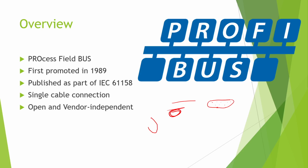Now, another fun part about this is usually we're going to have a purple cable. That's going to help denote Profibus. Why purple? I don't know. I don't think it's in the standard that you must use a purple cable. Really any cable will work, since it's not carrying that much voltage or current. Probably some 22 gauge wire would be perfectly fine depending on the distance you're traveling. But normally it's just a big hunkin' purple cable, with an outside diameter of maybe half an inch for the whole cable itself. The inner wires obviously aren't that big. This is pretty standard, and to be fair, the one thing I've actually seen with Profibus did use purple cable. So I gotta give them credit for that.